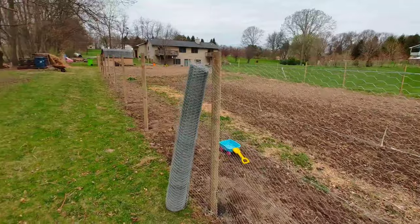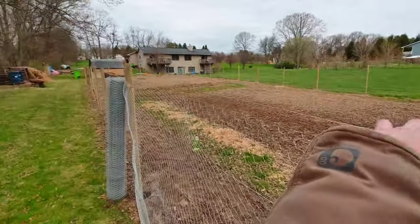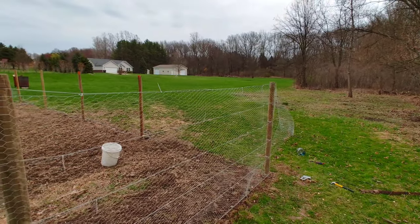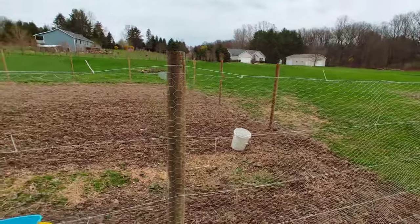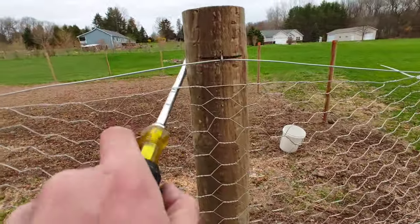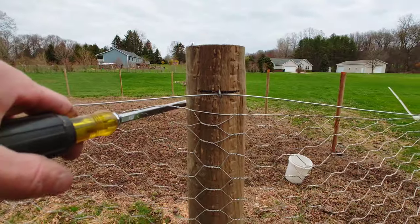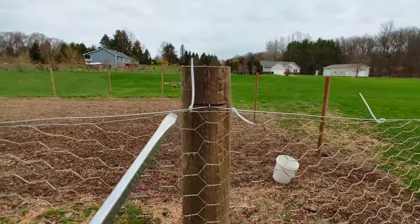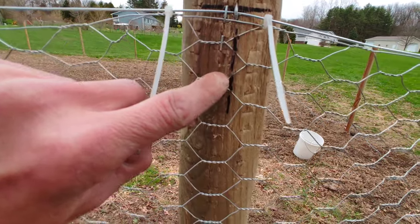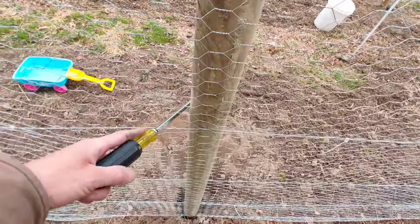We're going to roll the chicken wire over to the next post so we have some slack to work with, then add the tie wraps over to this wire all the way to the next post. Now we want to tighten this fence up and secure it to the next post. For this, I'm going to be using this flat blade screwdriver — wedge it in the post and pull it, and while you're doing that push it up to get it even with your first mark and hit it with a staple. Throwing a couple more tie wraps on it will help get it in place. Follow this pattern down using the screwdriver as needed to pry it, then hit it with some more staples.